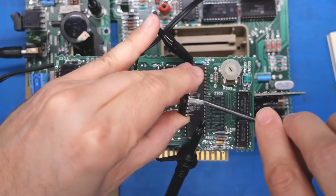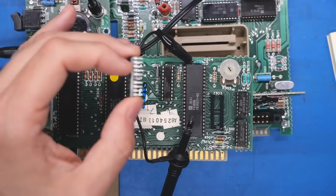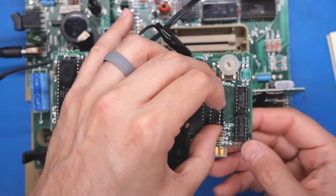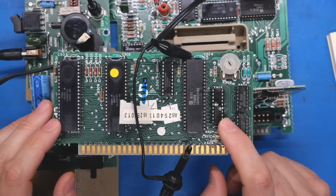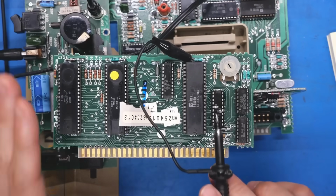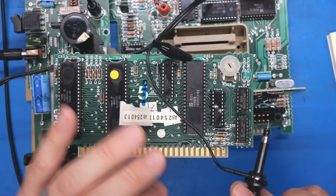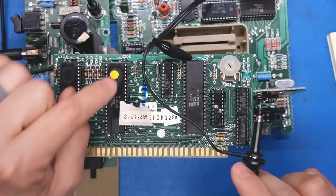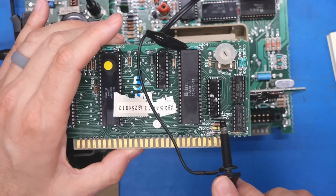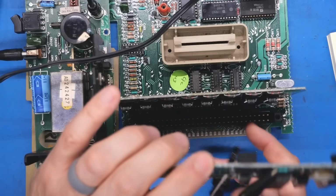So I just use my little chip lifter tool to bend the pin gently. While I'm at it, I'm going to DeoxIT that socket. I hate this kind of socket. They're the worst. So the chip's back in there, but the pin is floating. If I measure this once I power up the system and it's driving the bus correctly, that's telling us that something else on the computer is keeping that address line at that level. I mean, it still could be this chip is bad. Maybe the driver is blown out, but I doubt it.